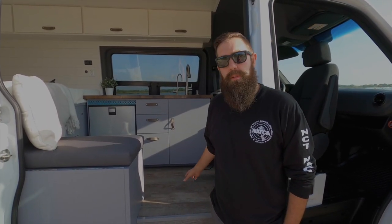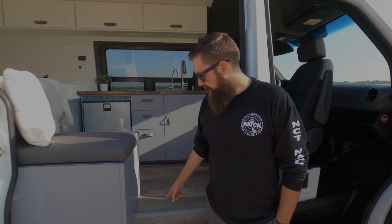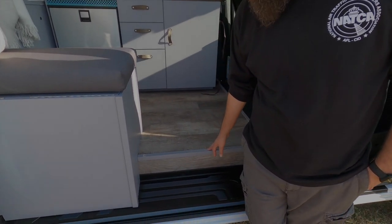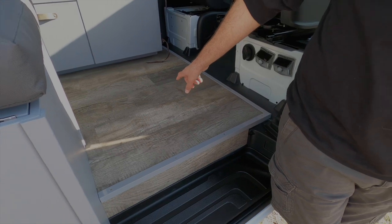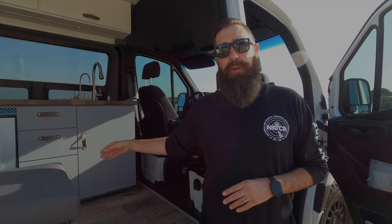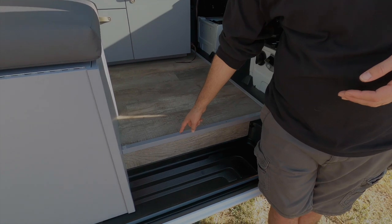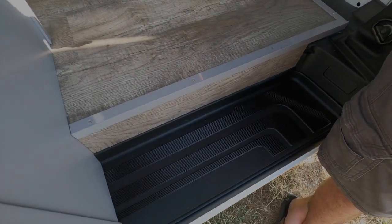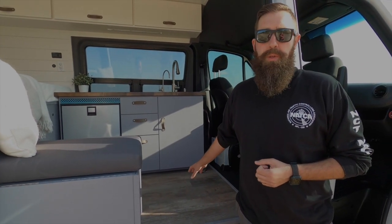The flooring brand we chose was LifeProof — it's waterproof and pretty durable vinyl flooring; I think we got it at Home Depot. The flooring trim is powder coated aluminum for durability with countersunk holes for the screws. Pro tip: if you're using vinyl flooring, it has a tendency to swell and shrink with temperature changes. So make sure you build in the proper gaps on all of your edges and make sure nothing is screwed through it. We have extra space underneath here with our screw holes to allow for shrinking and swelling. That's pretty key for vinyl flooring.